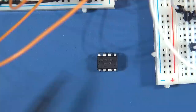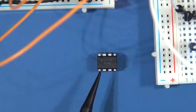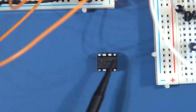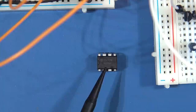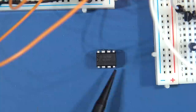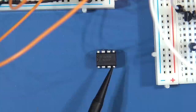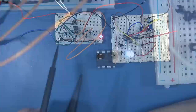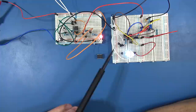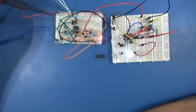Let's have a quick look at the circuit and then jump into the theory. Right at the heart of the two circuits we're going to discuss today is the 555 timer. This package is a DIP — dual inline package — with eight pins. It is made up of 25 transistors, two diodes, and 15 resistors. It comes in different types — surface mount, single, or ICs giving you two or even four 555 timers. The circuit I've built, using two circuits, could have been done with a single IC containing two or more 555 timers.